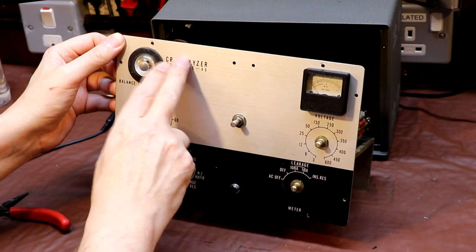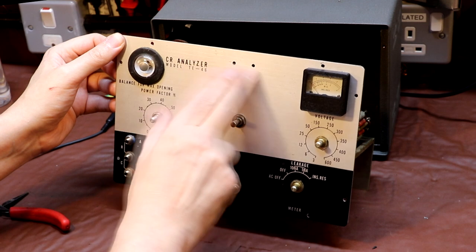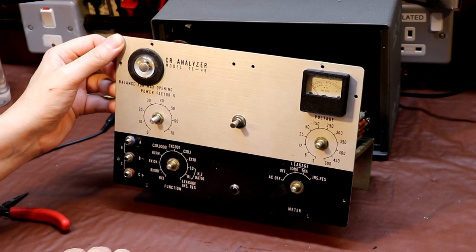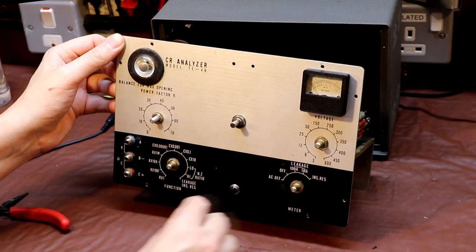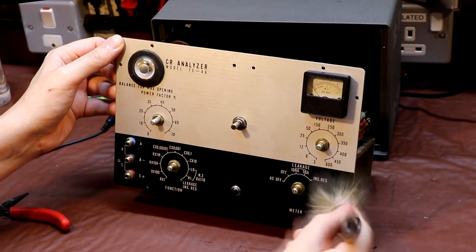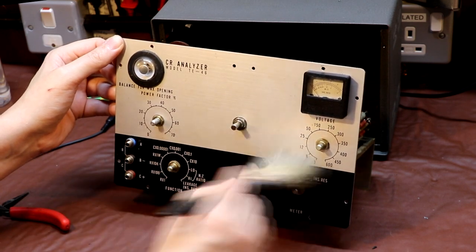When it comes to the face plate of an instrument we're never exactly sure what type of ink or paint has been used for the lettering. It wouldn't be the first time I've given one of these a wipe only to find I've wiped off some of the lettering. Having learned that lesson I try to be a little more careful now. Before we start cleaning with a solvent, I'm just going to brush some of the dust off, because if you start scrubbing while it's covered in dust, all that will happen is we'll rub the dust into the paintwork and scratch it.